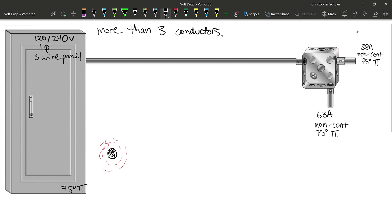We have more than three conductors with RW90 XLPE unjacketed conductors. One of the things to keep in mind when doing any type of branch circuit sizing is Rule 4-006 Subrule 1 — the lowest termination temperature wins. In this case, we have 75 degrees at our panel, 75 degrees at our loads, and 90 degree insulation. The 75 degree is the trump — that's the one that wins when we go to Table 2 to select our branch circuit conductors.